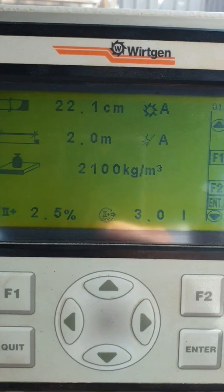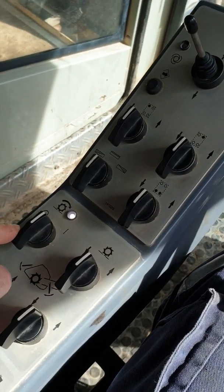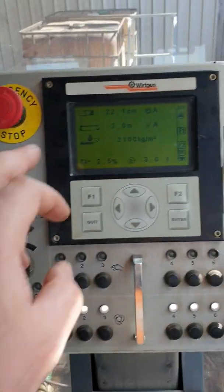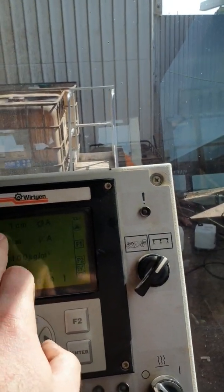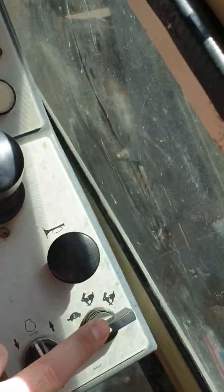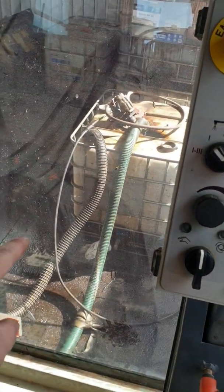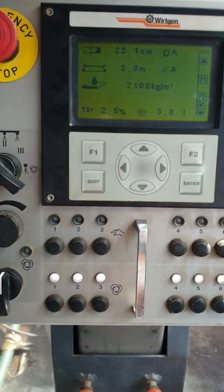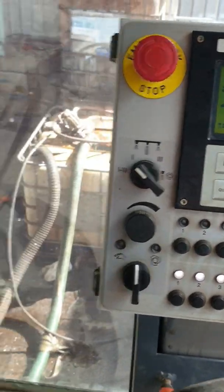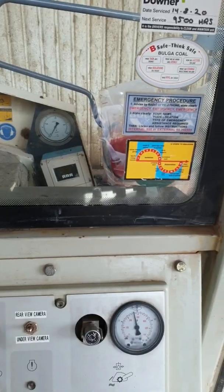For testing: make sure the drum is on but disconnect the solenoid — that's the safest way. Try to get a working depth, disconnect the drum angle sensor, and set it to a height that seems to work. Make sure you're in turtle gear. Make sure you've actually got fluid in the pipe — try and run on manual first — so that when you go straight to auto, the biggest problem I was finding was that the Pro Mass unit was telling me I had an empty pipe.